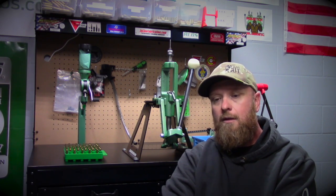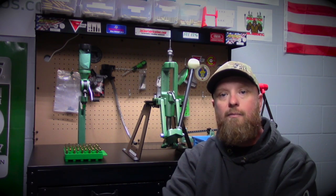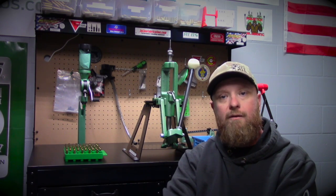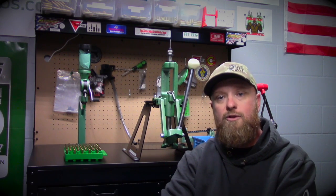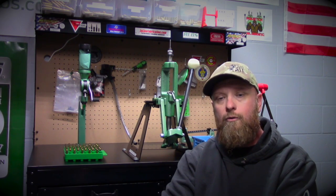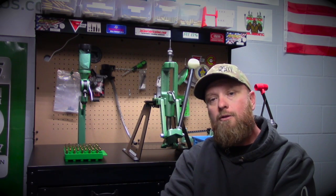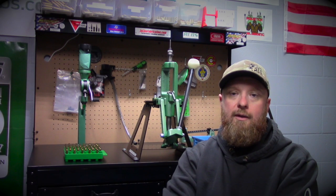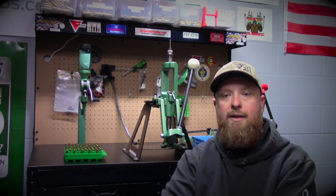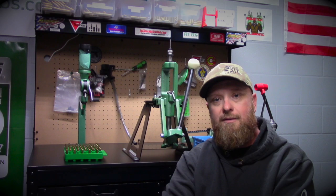So in the next video, we're going to get the sizing die set up on this press. We're going to go through lubing the cases up, doing sizing, and then a final clean of the case, which I like to do after I've sized, since I've got lubricant on there and I want to get that off. And then we'll work through all the dies, from installing the primer to doing bullet seating and bullet crimp, and then we'll finish it up from there. So probably 3 to 4 videos is what I'm looking at to get all this done and get everything conveyed in smaller videos that don't take up too much time.